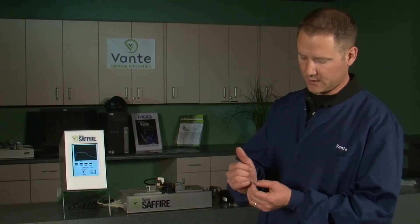What we've done is put a 125 thou taper on this dilator, brought the 85 thou wall thickness down to 5 thou, and we've done it flash free.